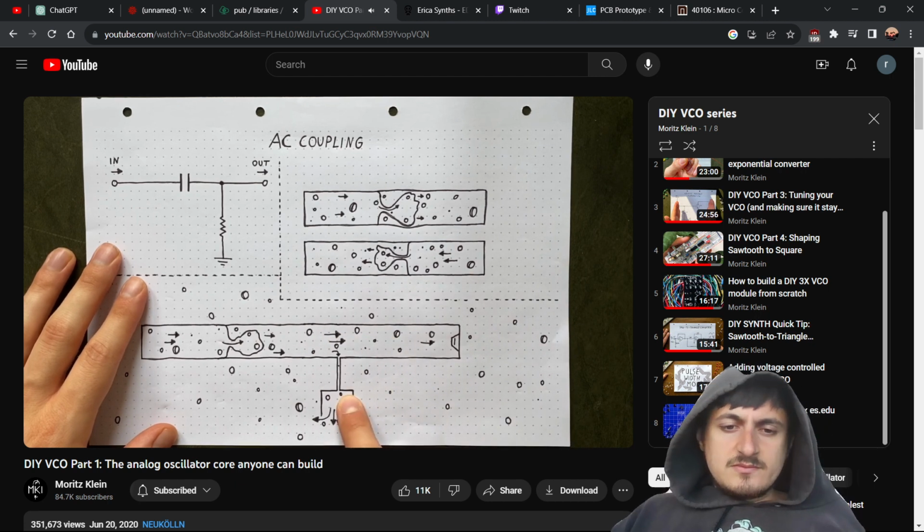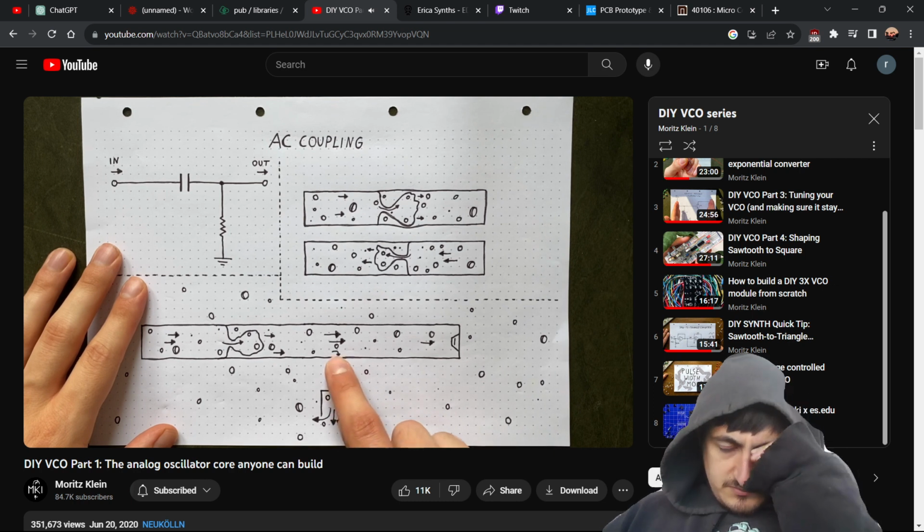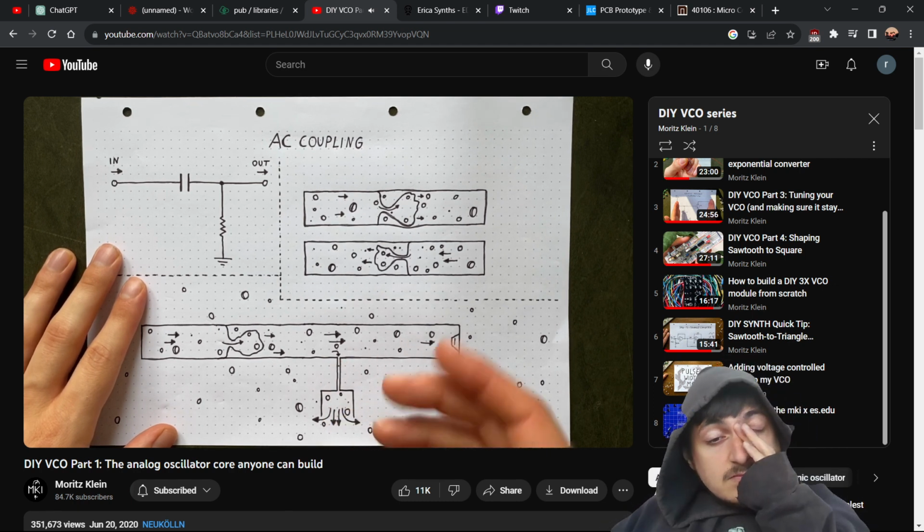If we didn't have the equalizing valve here, there'd be nowhere to go for that water. But since we do have it, the excess water can drain out through this narrow pipe, out of the system, until the pressure is neutralized and no water is actively flowing anymore.